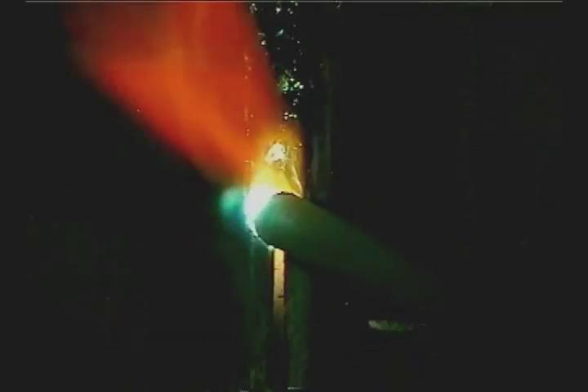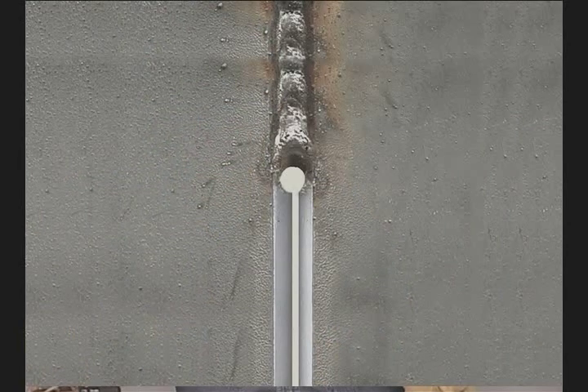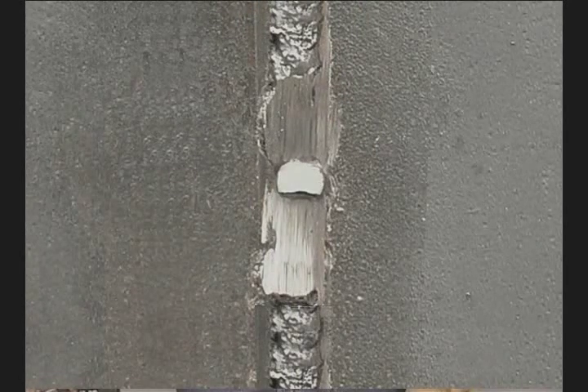Then move as fast as you can keep the gap filling in. If you're not getting all the way through, you will see filler metal squirting out behind the rod — back up in the bevel. Most of the light and sparks will be on the back side as you're building weld on the back of the metal. You want the amperage relatively high, so try starting about the same place as you'd run flat. If you do open a hole, stop right away, pulling the rod back over the bead. Restart right at the edge and keep going. When you finish the weld, grind the edges thin on both sides of the hole and fill it in.